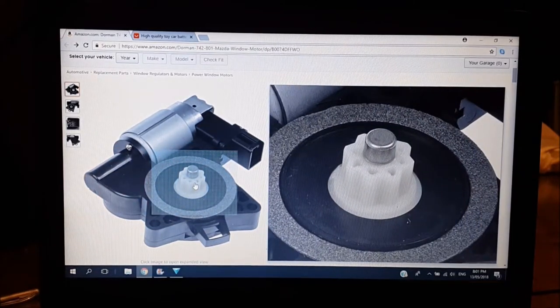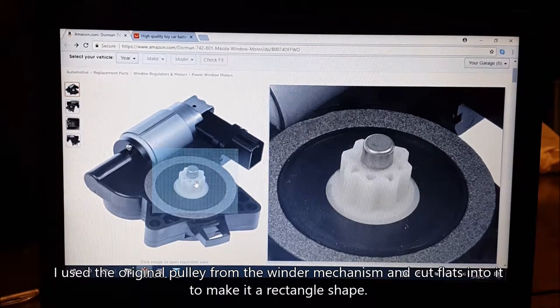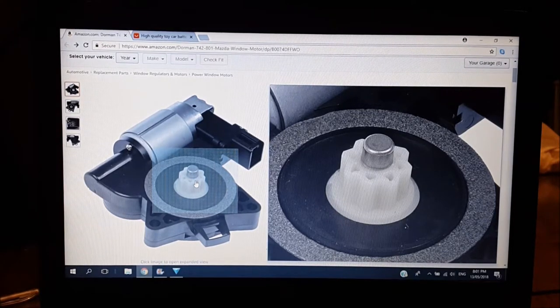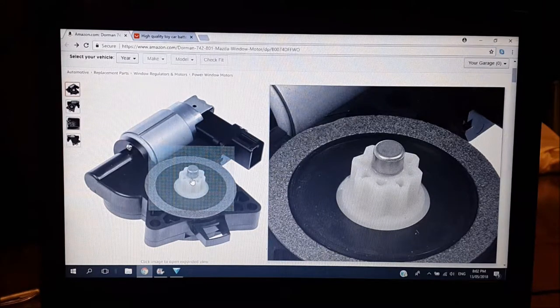There's another large pinion gear and a big cog fitted onto the shaft, which means you can very easily use a 3D printed hub — or anything cast or molded — to fit over that gear and get a very strong, robust connection between the motor and the main drive of your BB-8. These car motors are quite cheap to get hold of if you're willing to go to the scrapyard with a screwdriver and spanner. They also have just about the right rotation speed, and they're 12 volts — a useful voltage since many other BB-8 electronics also run at 12 volts, like the amplifier.